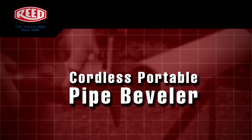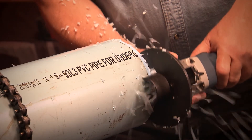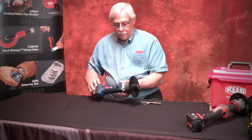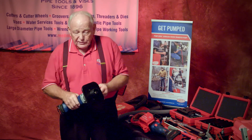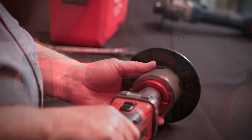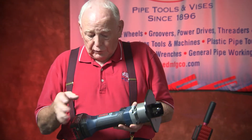Our next cordless tool is our PVC cordless beveler. The beveler has a 15-degree router on it. You set it on the pipe and use a counterclockwise rotation — not clockwise, as it will chatter. It is powered by our cordless battery or Bosch system. It has an adjuster so you can set the depth of your cut. You can bevel 8-inch PVC in approximately 15 to 20 seconds. As a feature, you can also use DeWalt or Milwaukee by purchasing the head separately along with a Milwaukee or DeWalt grinder to utilize those battery systems.